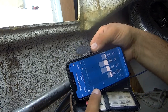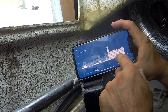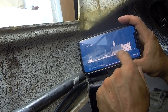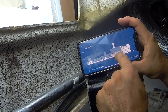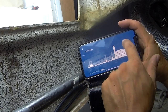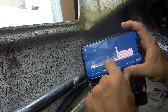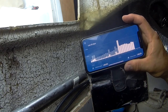Taking a look at my history in the app — you can see when the batteries were being charged, and then it says it's hit enough charge and can't charge anymore. The gray is the bulk charge. You can click on a day and see: on this day I had 12 hours of float, one minute of absorption, and three hours of bulk charging. Interestingly, by the graphs you can tell which days I actually motored, because motoring charges the batteries differently. Each day you can see how much I'm using.